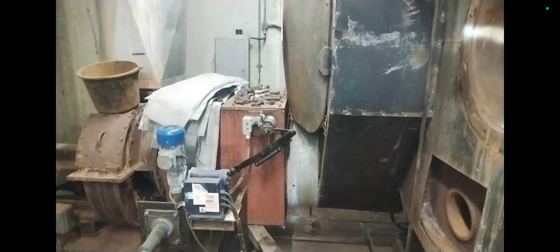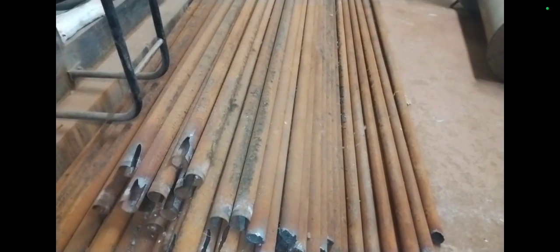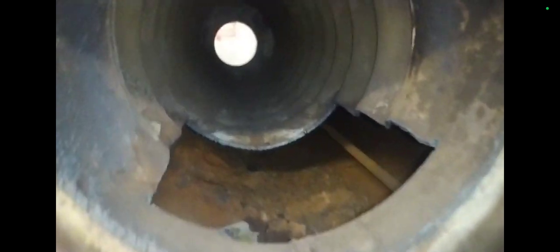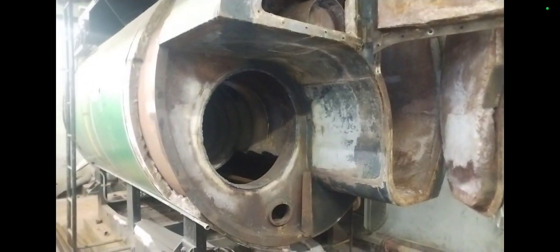This is the back of the boiler again — just showing you, look inside the unit. These are the tubes that need replacing, and here they are from another angle. It's nice when you can climb inside a boiler. Found this air inlet on a room-sealed gas-fired unit with a hole in it — it had to be shut off. Another hole as well.